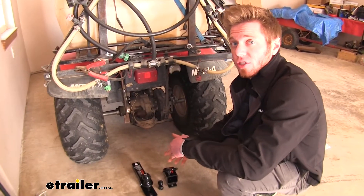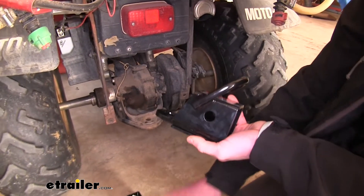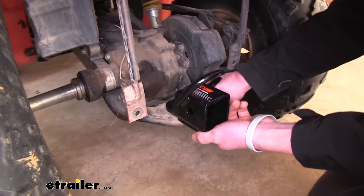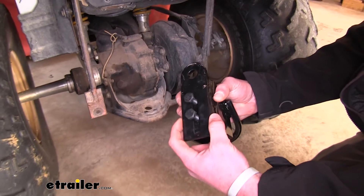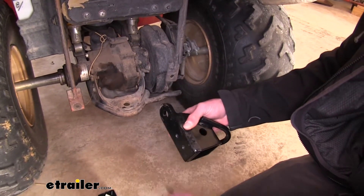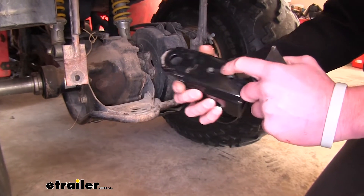If you don't have a two inch hitch on your machine and you just have a clevis, I would suggest grabbing one of the full kits. What we're going to get with this kit is obviously our ball mount, but we're also going to get this converter that's just going to go over this hole here and thread down with the included hardware. There is a stabilization plate, and if we only have one pivot point for this ball mount it might want to swing, so we do have threaded holes in the bottom.